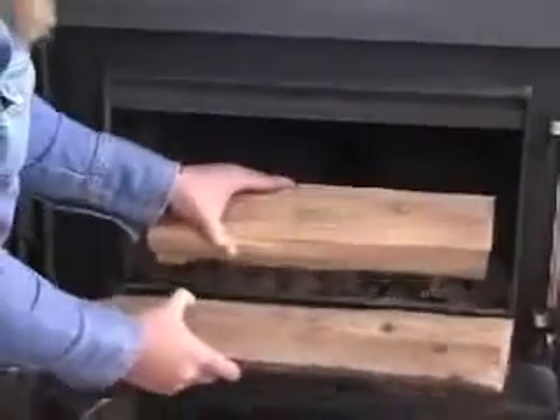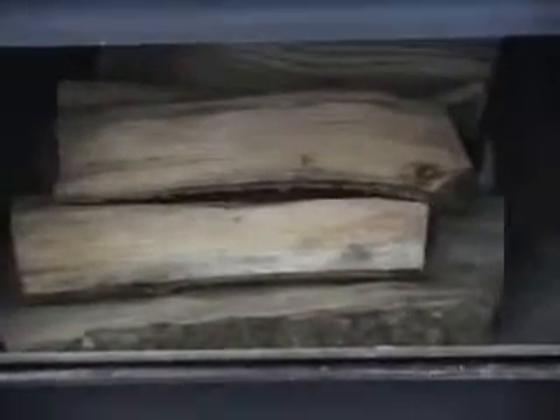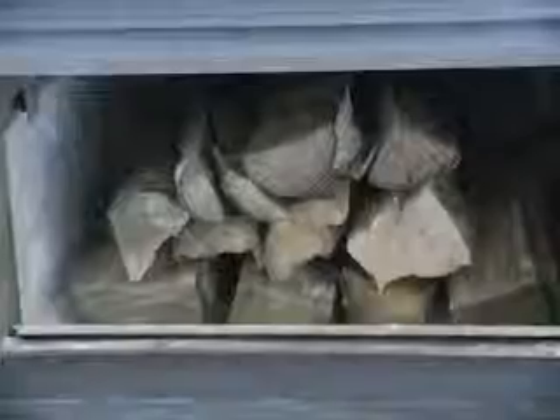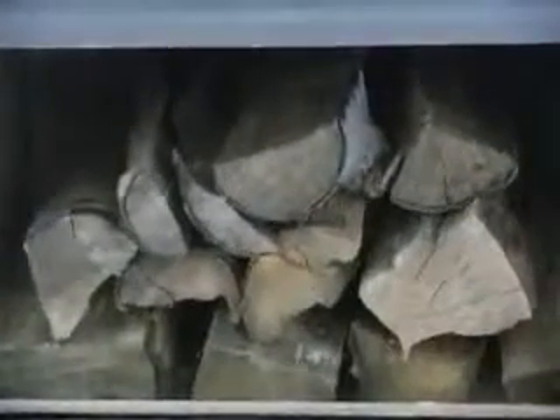Now because the floor of this firebox is roughly square, I can place my logs either north-south or east-west in the firebox. The fireboxes of a lot of stoves are oriented either one way or the other, so you might not have that option. And why does that matter? Well, a load of wood breaks down more slowly when placed east-west because the air isn't able to penetrate the load as much as it does a north-south load. That makes east-west loading better for mild weather when you want low heat over an extended period. North-south loading is better in very cold weather, both because it tends to burn faster and hotter, and you can fit more wood in the firebox because it can't roll out.